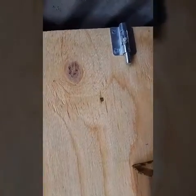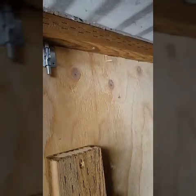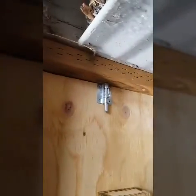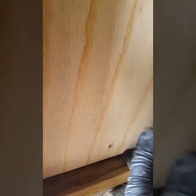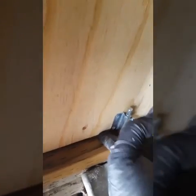And when you cut the door and you set it into place, you want to make sure you have a little gap on the sides. Okay, that way when it expands, when it gets wet or cold, it has room to expand and still be functional. But you don't want enough of a gap that you can get your finger in there. If you can get your finger in there, a mouse or a rat can get in there and start chewing it away and compromising it. But you want to make sure it sits firm on all sides.